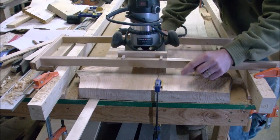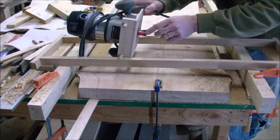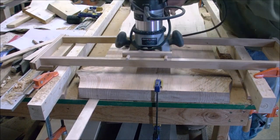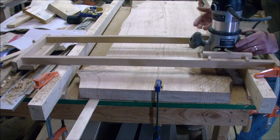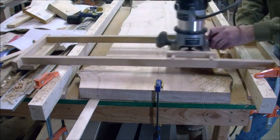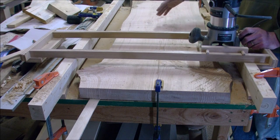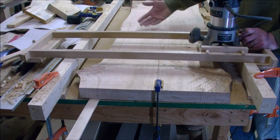I tried to find my highest spot first on the board, then simply adjusted the depth of my router so that it was taking off a small amount first — not hogging off an eighth or a quarter of an inch. Then it's simply a matter of adjusting your height. I started at one end, turned on the router, holding onto my base so I can go left and right, and simply fed the router across taking passes like that — the whole length of my piece, keeping it secured down to the table. Once I got to the end, I adjusted my depth and took small amounts of material off because I didn't want to blow out any of the top. Then I went back through, flipped it over, and did the backside.